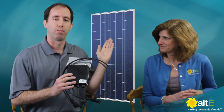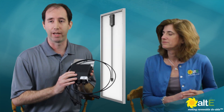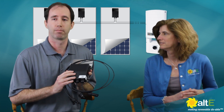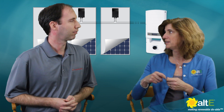Depending on what kind of installation you're dealing with — for example, a pitched roof — that could be a little more complicated. Keeping your balance and installing all these components in a constrained area is not always easy. Now, all you have to do is install the smart module as you would a standard module. The leads coming out of the module end with MC4 connectors and you can just string the modules one to another as you would with normal modules. You get the advantage of the DC optimizer but without the additional labor associated with wiring it.